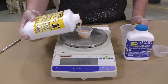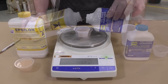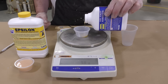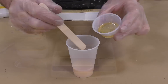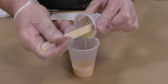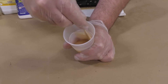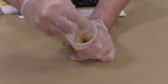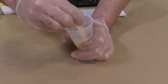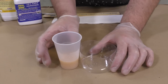The Epsilon with the 101 fast hardener has a mix ratio of 100 parts of Part A to 20 parts of Part B. We can go ahead and mix the two components together — as always, make sure you're scraping the sides and the bottom of your mixing container. It's really important that you mix these components very thoroughly so that we don't have any unmixed product end up on our model. Once thoroughly mixed, transfer it into a larger container.